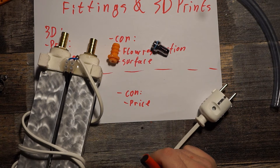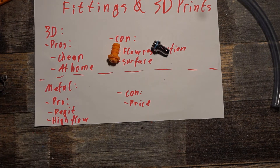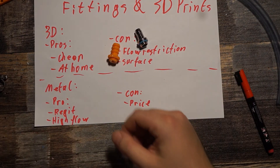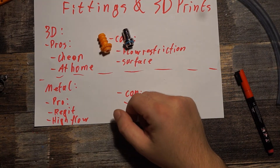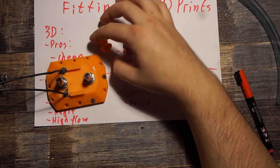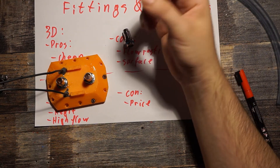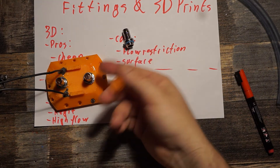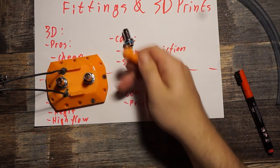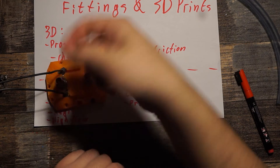It's never a bad idea to seal it off with epoxy after screwing them in — especially when you want something to run for a long time, it should be tight. Use more epoxy on everything! Also, I found that to get threads into parts like these, OpenSCAD is quite practical. You can search online for a quarter inch screw fitting and then combine the parts so that the fitting thread gets subtracted from the part, giving you a threading you can screw into.